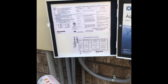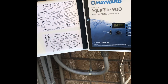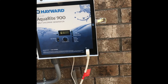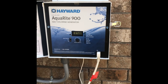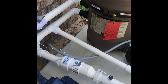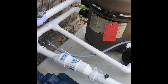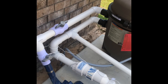So if it gets up in there, it's a little high. When I turned it on, it says 'power and generating.' That tells you that the T-cell over there is doing what it's supposed to do. As the water comes through — salt is sodium chloride — that little cell right there, by electrical charge, it has a positive side and a negative side. When the water flows through there, it uses electricity to get rid of the sodium, and what you have left is chlorine.